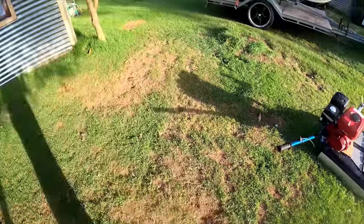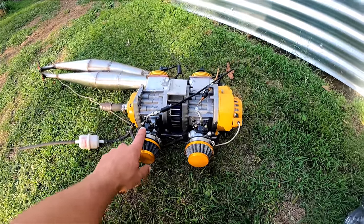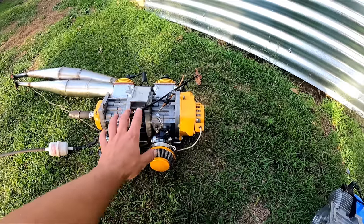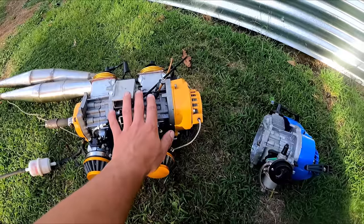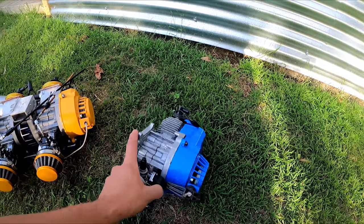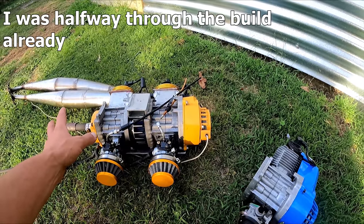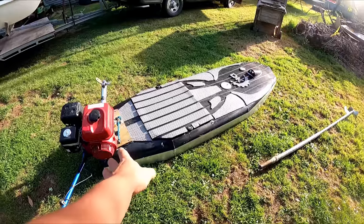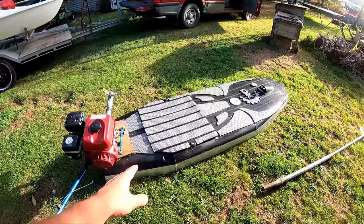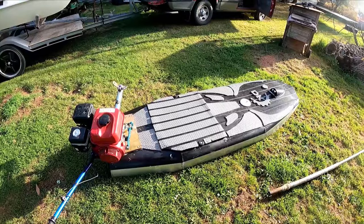I'm disappointed that the jet unit didn't work very well. There was a guy commenting on my channel that knows about these motors — he raced pocket bikes, which these come out of. Apparently these are supposed to be the high-performance ones, but even the cheaper ones might be better. So these might be only putting out two horsepower each or something crazy like that. Not enough power, especially to run a jet unit. I've still got the jet unit and everything for this board, so I can change it back — but I'd probably only do that if I can find a really powerful two-stroke motor.